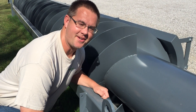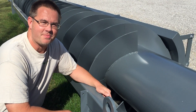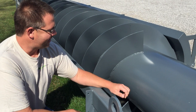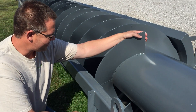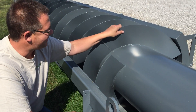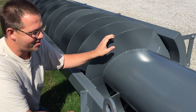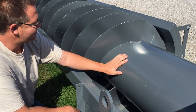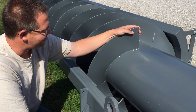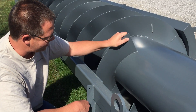This is a continuation of the last video on this 1.5 kilowatt screw generator. We're going to talk about a bunch of the components. The first thing we'll talk about is the screw itself. The screw in an Archimedes screw generator is the rotating part that is between bearings on your water turbine. The main component of the screw is the center shaft, which has flights connected to it. In this case we've got three flights, or starts, surrounding it.